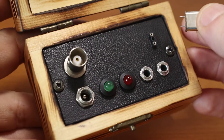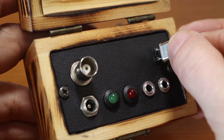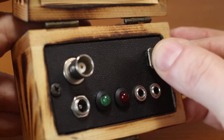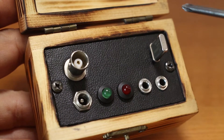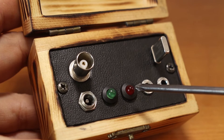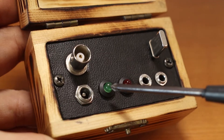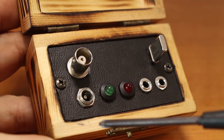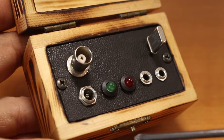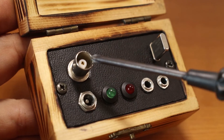I have this removable crystal socket, which is actually some pins that I soldered with a little hole on the other side. This one is for the CW key, this is the audio output. This red LED will light up every time I'm transmitting. This is the power LED and it will light up as soon as I plug in the power supply, and if I run out of battery this one will die so I know the transmitter is no longer working. And of course the antenna.